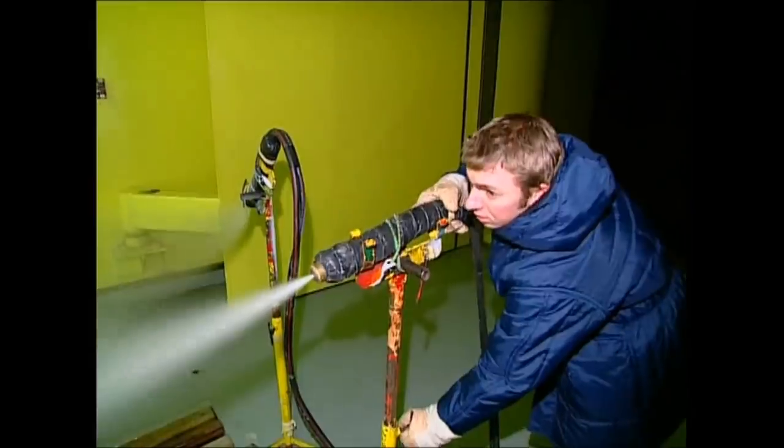To make sure the rubber quality is high, samples are taken from each batch and run through rigorous tests. Here, dirty water is sprayed on a mock windscreen and the wiper's ability to clear it is monitored. This nozzle is blasting snow at the car in a wind tunnel at minus 30 degrees Celsius. Each wiper has to survive 24 hours in these conditions, non-stop. If they can't clear the snow or they jam for any reason, they fail.